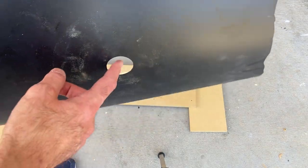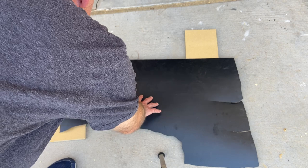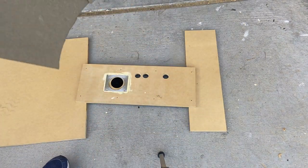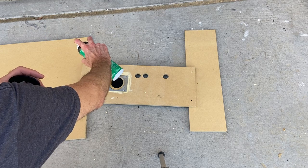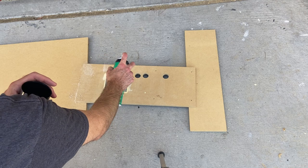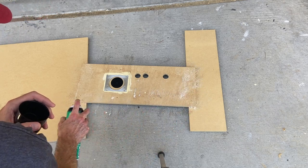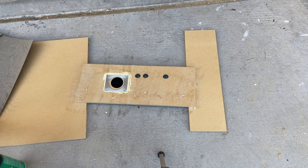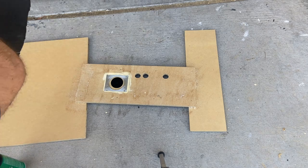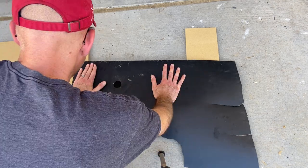Then we're going to place a piece of laminate on top of the control panel. I pre-cut a hole to make this an easier task instead of cutting the hole after the laminate is glued on. We're going to use Spray 90 — I strongly recommend using this and no other brands. We're going to spray the top of the control panel first, keeping away from the washer and the joystick panel. You don't want to get any glue in there and force that washer to stick. Then we're going to spray the backside of the laminate, keeping it away from that hole where the joystick or washer will sit. Place it on top, press it down, let it dry for about 10 minutes, and then we're going to have to route and trim.